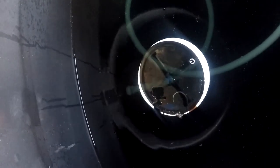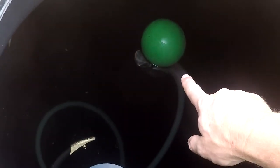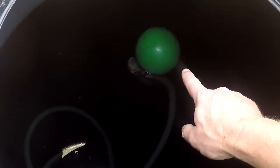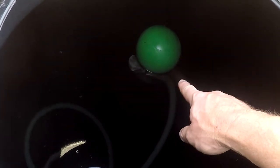So coming up at the top of the hose, we have the stainless steel suction inlet, and that keeps any major debris from being sucked into the pump. You can see this tank water, except for a little bit of dust on top, is very clean. We also have a ski buoy. So I attach the inlet and the hose to the ski buoy a couple inches below the water, and it pulls the cleanest part of the rainwater through that inlet.